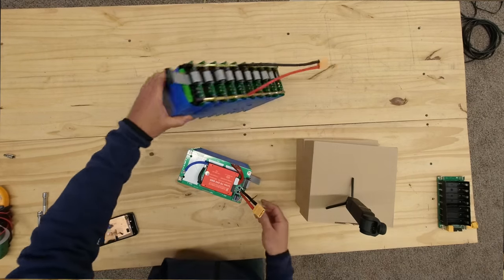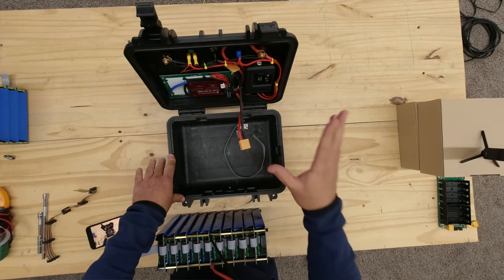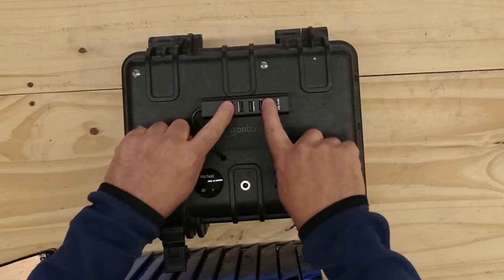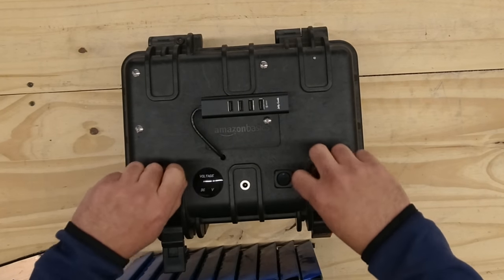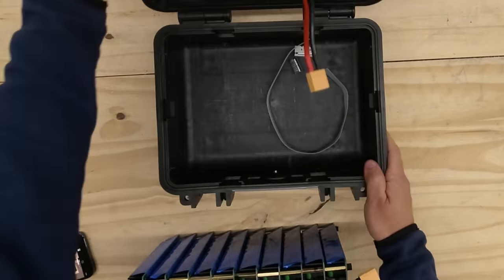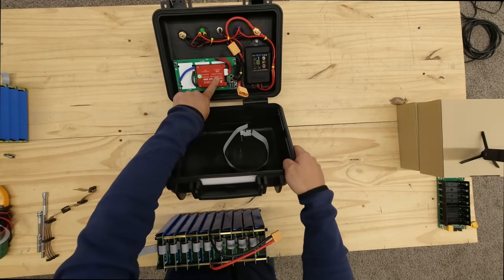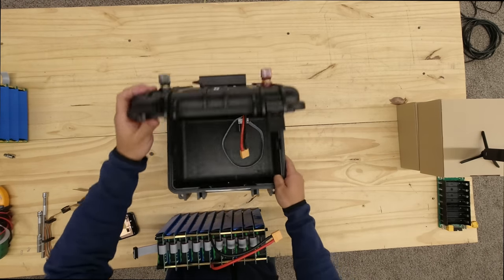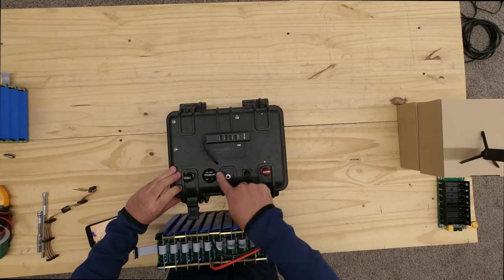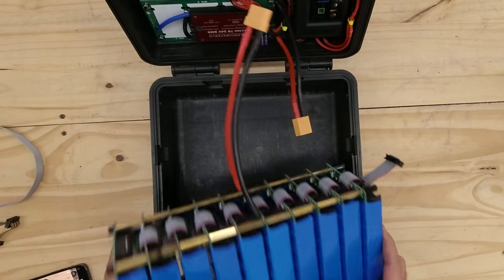To install this we'll need the case for our battery. This box is what I commonly call a DIY solar generator — basically a large power pack. It's got USB ports, a voltage meter, and two jumbo terminals to serve full 24-volt power into devices like inverters and other 24-volt appliances. Inside it's got a solar charge controller, the BMS, a meter, a solar plug where you connect your solar panels, and a switch to turn on the meter and USB ports. You just drop it in here.